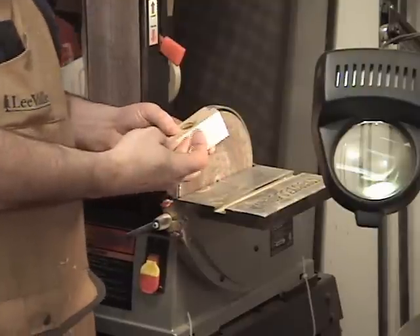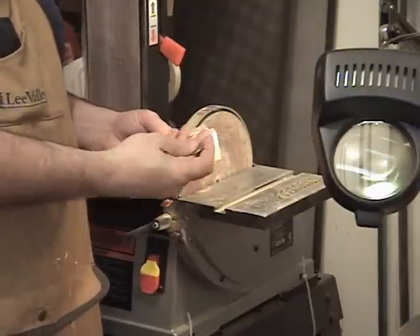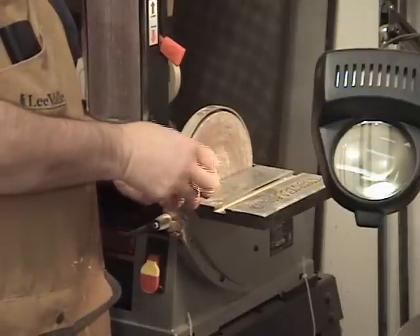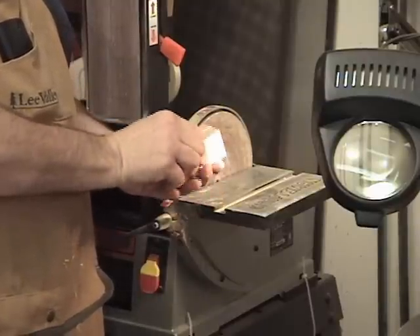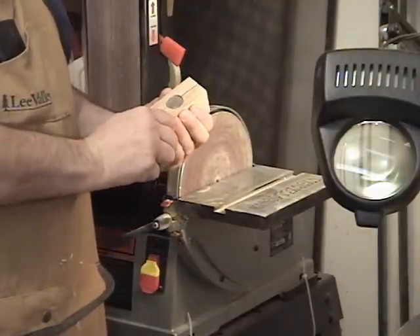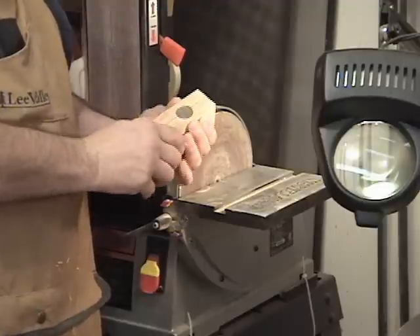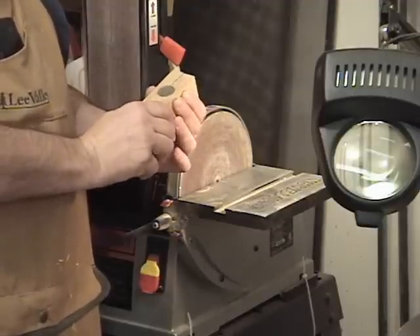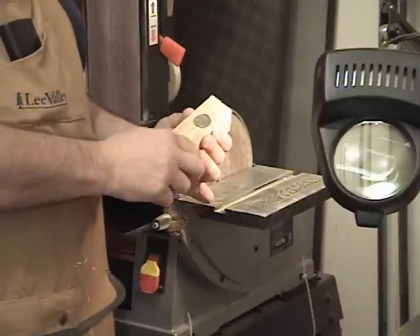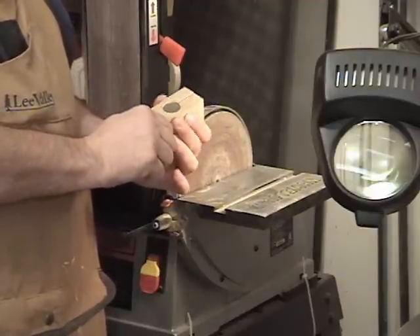You don't want to go too far before you test the fit of the quarter. I've got my quarter now — I'm going to hold these two halves together, set my quarter in on the ledge, and make sure that when I apply pressure that the quarter is good and tight. Just that little bit we took off at the sander has already got it where I want it. You can always come back and take a little more off if needed.